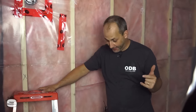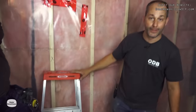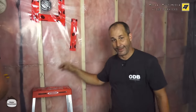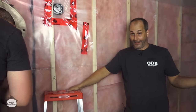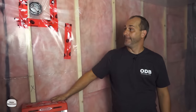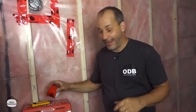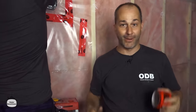That's just about it for insulating. One other thing you could do — not necessary on this project — is use acoustic seal, the black tar-like substance that comes out of a caulking gun, at your bottom and top plates where you have more than one piece of lumber together. That cuts down on air drafts and can bring quality up to 99 to 99.5 percent. If you have any questions please ask in the comments below — this information will change from district to district. Hit the subscribe button for more videos covering everything from inside and outside, top to bottom of the house.